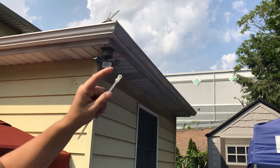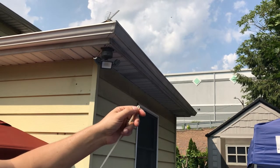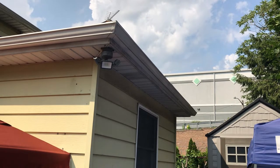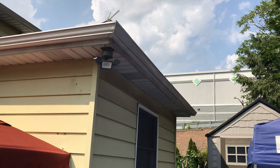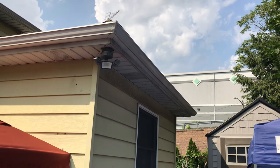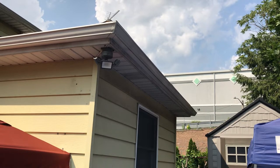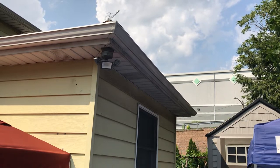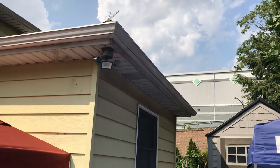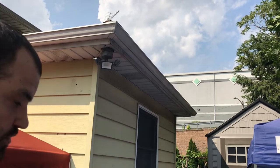What other people do is just drill it in, zip tie it, and that's it. The problem is if this cracks or breaks, you've got to put a new one in. You could take the screw out and drill it back in if you have wood, but I'm using very thin aluminum. If I keep taking the screw out and putting it back in, the hole's gonna get too big and loosey-goosey. So I'm gonna use a zip tie to hold it in place so I can replace it without messing with the screw.